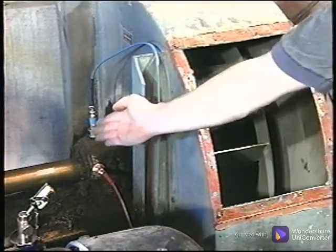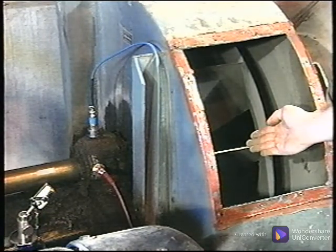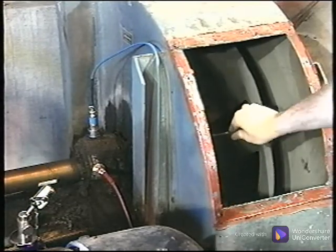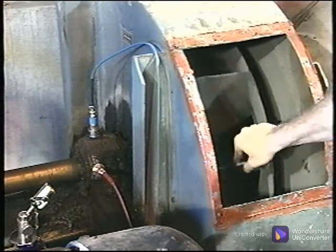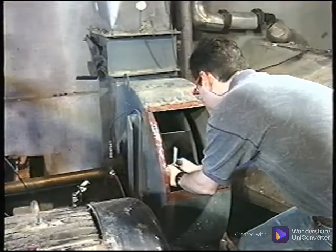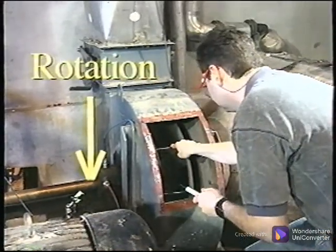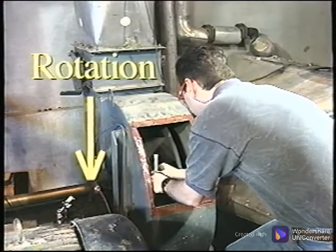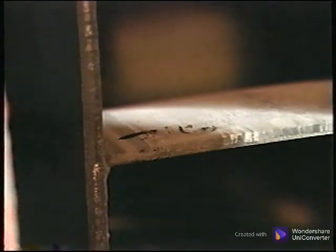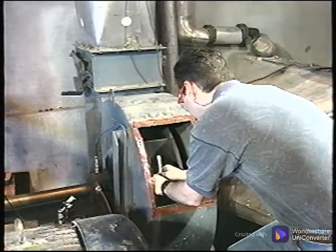Take extra effort to make this as accurate as possible. This fan blade now becomes the zero degree mark. There are ten blades, so they are thirty-six degrees apart. The blades are attached to a plate, and the balance weights can be attached at any angle on this plate. Therefore, we will mark the blades with the appropriate angle. The fan rotates this way, so the angle increases against rotation, which is the true phase method of measuring. The second blade is marked thirty-six degrees, the third seventy-two degrees, and so on.